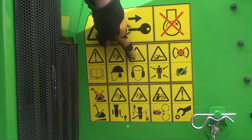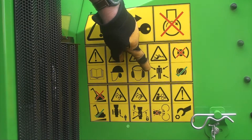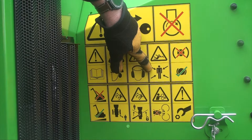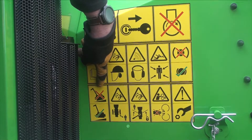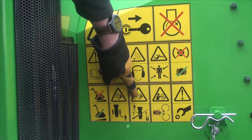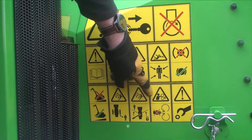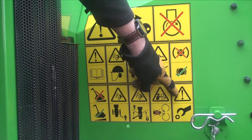Because of noise levels, wear adequate ear protection. Because you could be pulled into the machine, wear no-snag clothing. Make sure the brakes are on so the machine is static and will not move. Try to get the machine level, be aware around machinery being manoeuvred, lock off your discharge chute, and keep your arms and legs out of the machine. If you have any loose fixings, tighten them up.